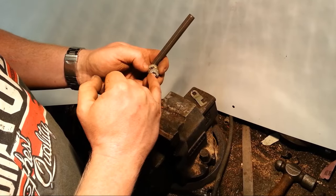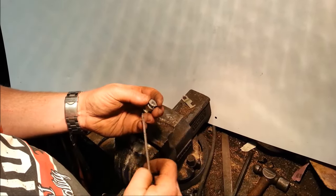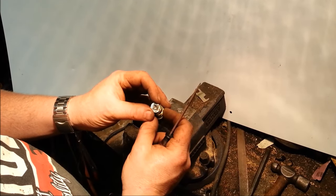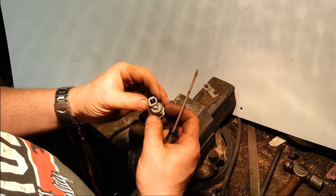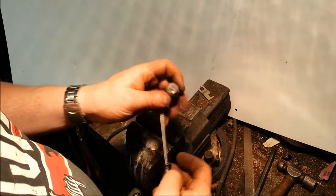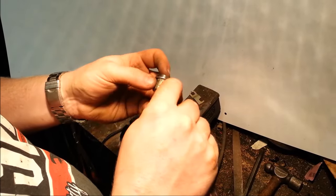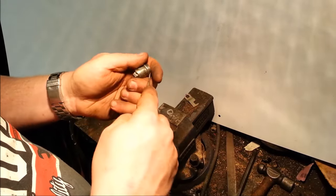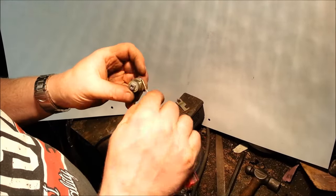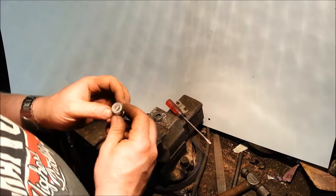Like I said, some of them have a Phillips screw or flathead screw that is actually threaded in there and retains it. Then there'll usually be a little groove right there that only allows the key to turn a quarter turn either way, otherwise the key will just spin all the way around. Now the lock cylinder will push out through the front. This particular one has a shielded lock hole and also a stainless steel retaining piece around the whole front that needs to come off — a lot of locks don't have this. So I'll just pry it up and pry it off the front.